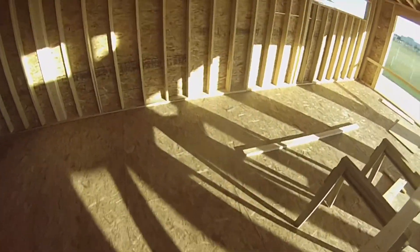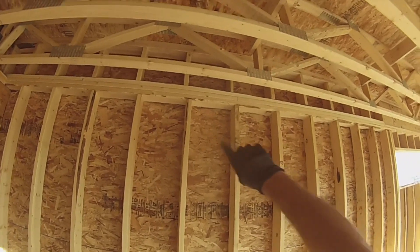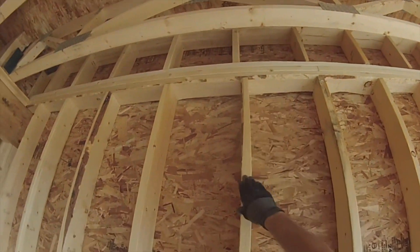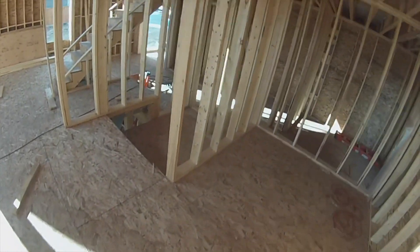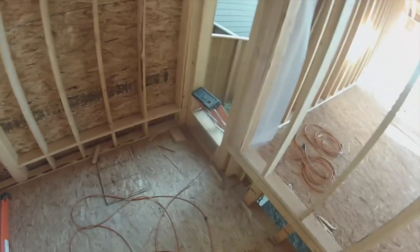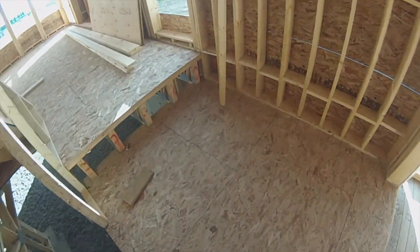So a few little odds and ends, actually on the outside. When I sheeted the exterior wall, I ran the sheeting 18 inches down - so it would actually cover 19 and a half, coming down to the top cap plate of this wall. So I just spent some time stapling all that off. And then I made this window wrong - I thought it was the same depth as that window, and it's not because it's kind of awkward staring into the neighbor's window. So I just framed this in, fixed it up, cleaned it up. Really good day today - pretty much got the whole second floor back framed.